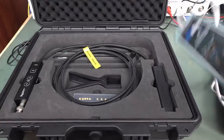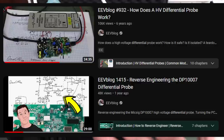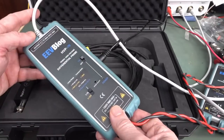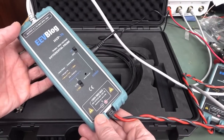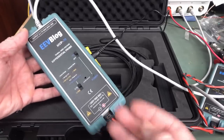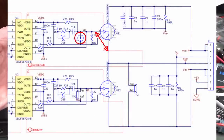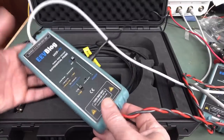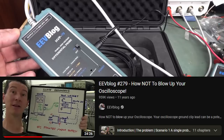The next type is your high-voltage differential probe. I've done several videos on these — actually reverse engineering them, explaining how they work, testing them, doing common mode voltage tests. You use the high-voltage differential probe when you want to measure high-voltage stuff or things raised above signal ground, like mains switch mode power supply high-side driving transistors — an essential bit of kit.